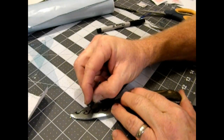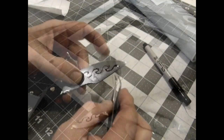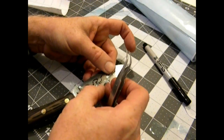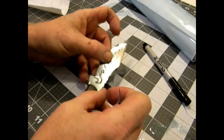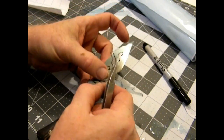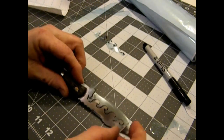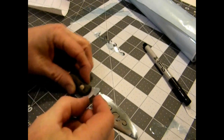Once it's all completely outlined, I used tweezers just to get it started and then pulled off the area that I want to etch. You definitely want to cover the very edge of the blade — you don't want to etch very close to or onto the actual edge of the blade, because that thin steel would get damaged by the etching. At this point I wanted to add a little bit of additional detail.